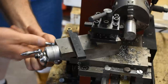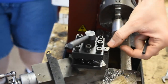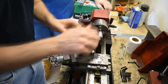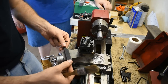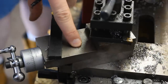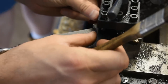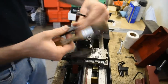Since we're putting a different tool bit in, we'll back this off because the position won't matter. You can see all the scale and junk that was built up — brushed it off, and now it's all in the brush, that dark schmutz that was on there. In machining, these little spirals and chips will sit on the tool and actually twist it. Even these tiny little hairs of material — make sure to wipe that off before cutting. That's why we keep Chirpy here.